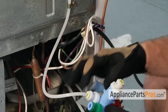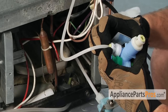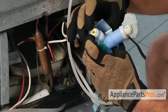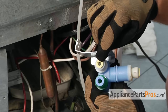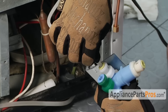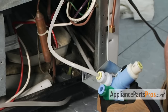On these type of fittings, if you have to take them out or disconnect them for any reason, you have to push on the fitting ring and then pull the tube out. When you push this ring down it releases the four teeth that are inside so you can pull the water line out. Go ahead and put this one back in, make sure it seats all the way, and give it a little tug to make sure it's locked in there.